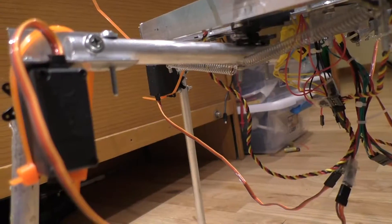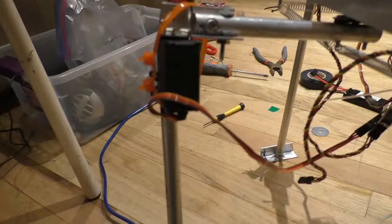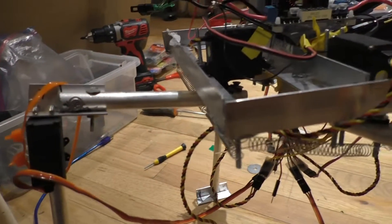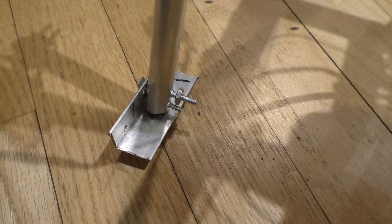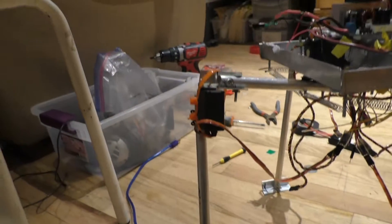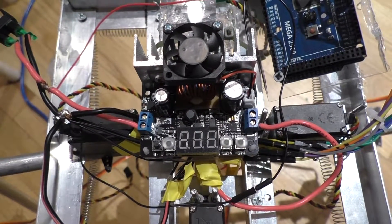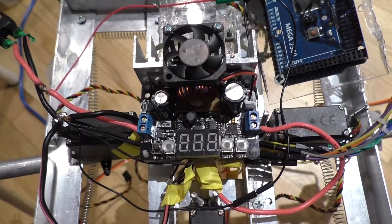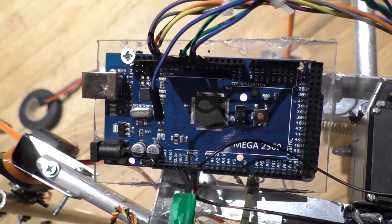A Raspberry Pi. The current design consists of eight servomotors as joints, four 12-inch aluminum tubes for the vertical legs, four 6-inch aluminum tubes for the horizontal legs, eight tension springs to stabilize any outside torques acting on the horizontal components, four 2.5-inch aluminum angles to use the torque from the normal force to counter any stray movements from the body of the quadruped, number six nuts and bolts, a voltage regulator to step the voltage to the servos down from 7.4 volts to 5.3, and an Arduino Mega board to act as the microprocessor.